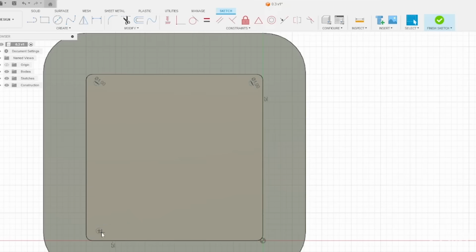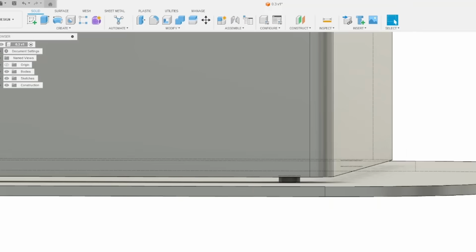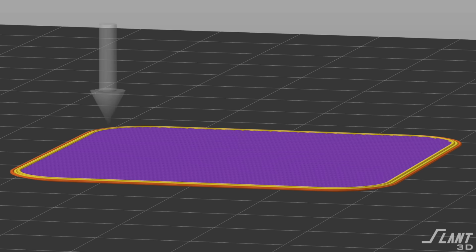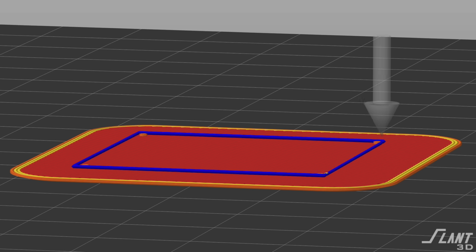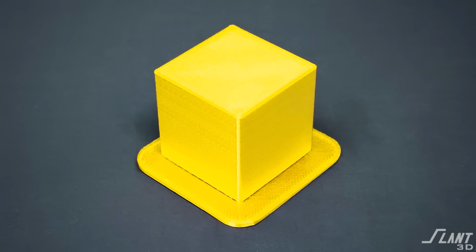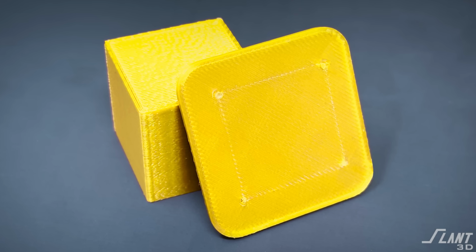What you can do is you put some small 1mm struts underneath the edges of the part so that they are physically connected to the raft, and now the raft can hold down the part and serve as increased adhesion holding down the piece. But when you remove the part, they're 1mm struts, so they're very easy to either snip off or just manually break off. You essentially create a very simple zipper that's able to break away, and then you can still have good strength adhering to the raft, but a part that's easy to remove and process.